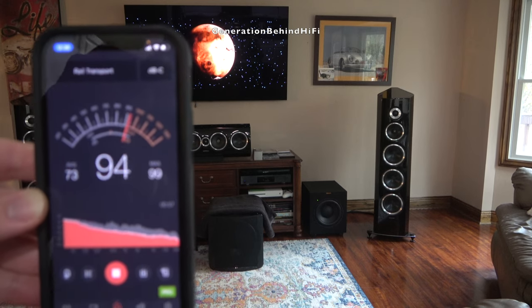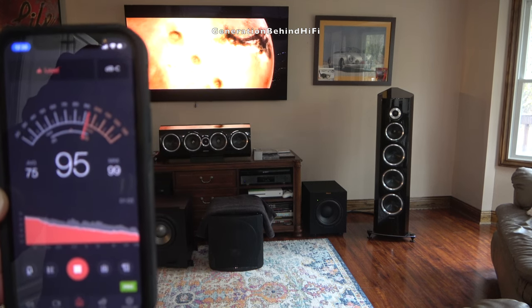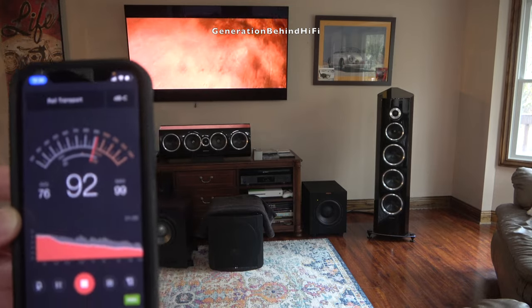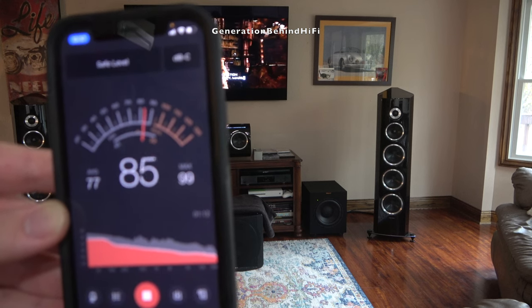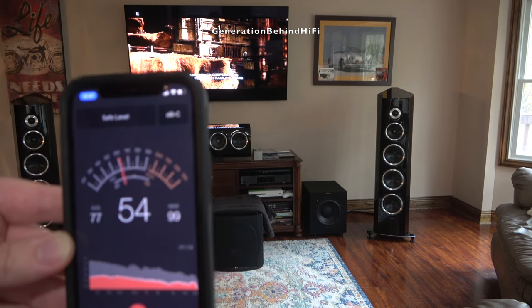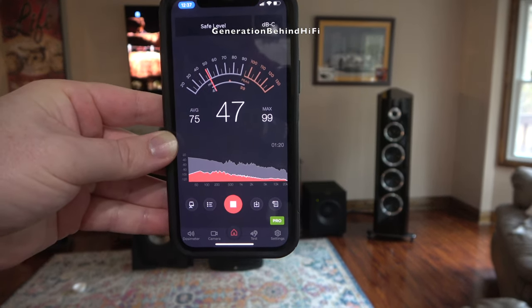Another important variable to consider is transient response. Transient response is a term used to describe a speaker or subwoofer's ability to deliver crisp dynamics without distortion or overhang on notes. A more casual definition is the speaker or subwoofer's ability to stop and start on a dime. One of the traits of a sealed box design is its internal air spring that acts like a suspension, which helps with achieving good transients. The fact that a sealed cabinet design has a gentle roll-off slope of 12 dB per octave also helps. I took this screenshot from JL Audio's website, which said: when it comes to subwoofer drivers, transient response is actually a function of accuracy in relation to time rather than frequency.